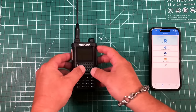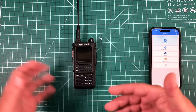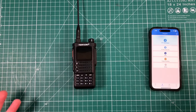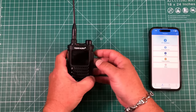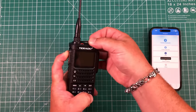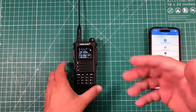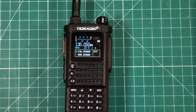If you just have this on GMRS, it's going to have all your GMRS frequencies, including the repeaters with offsets and everything — all you need to do is update the CTCSS tones. Under the unlocked version, you're going to need to program everything in. So let's take a look at the unlocked version and get acclimated with the screen. It's basically going to have everything you're going to want to know — obviously, here's the frequency. There's nothing programmed because it's a wide open radio, but you've got your frequency, and right now we're in VFO with no channels saved.